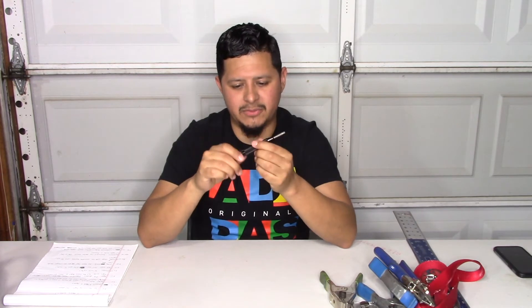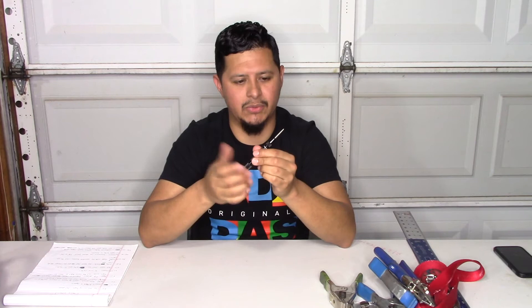The next tool is the metal center punch. We use it to do any type of markings on your metal jacket — most of the time for doing the X patterns on your metal jacket on the ducts. You've probably driven by a duct outside with a metal jacket and seen that X pattern; we use this tool to do those. It runs about $10 to $15 and it's great because you can turn it to control how heavy or light you want the punch to be. You can find them at any Lowe's, Home Depot, or Ace Hardware.